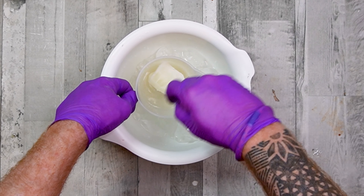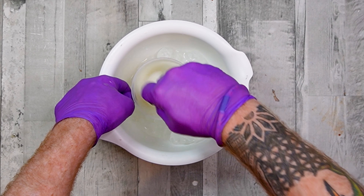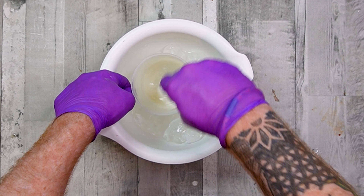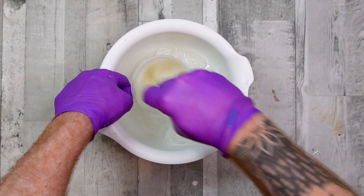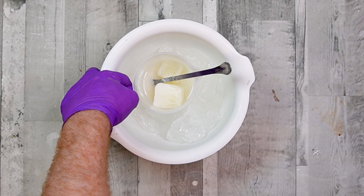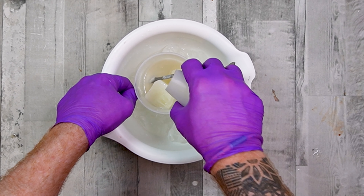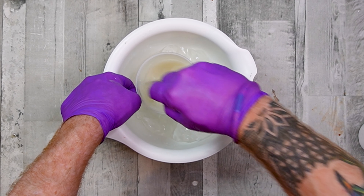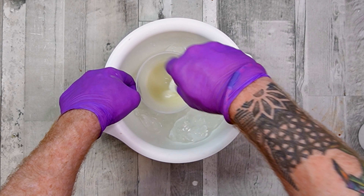We've got some melting going on there, but we're still keeping it nice and cool — just stirring continuously. You don't want this to go orange, otherwise you get quite an acrid smell with it. Our temperature is going up — we're about 17 degrees, but we're keeping it nice and low in that ice bath. A little bit more of our sodium hydroxide into there and stir. Slow and steady wins the race on this one.